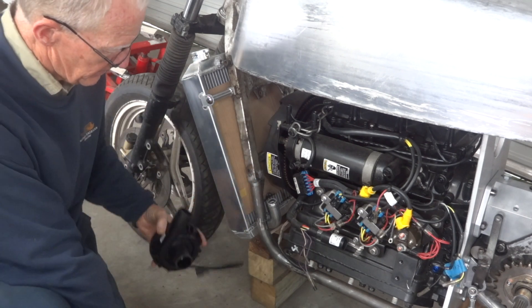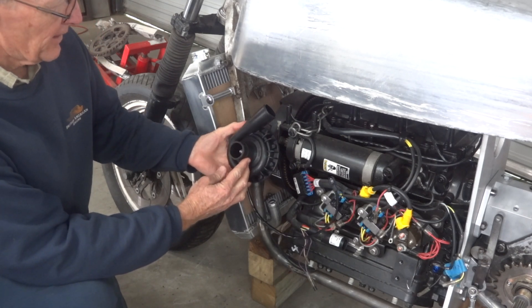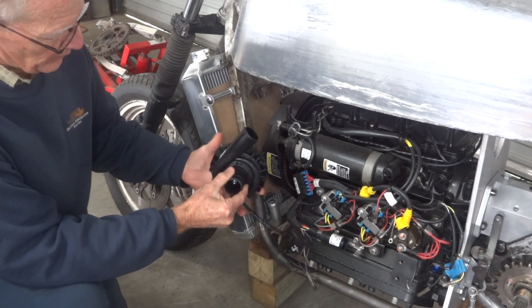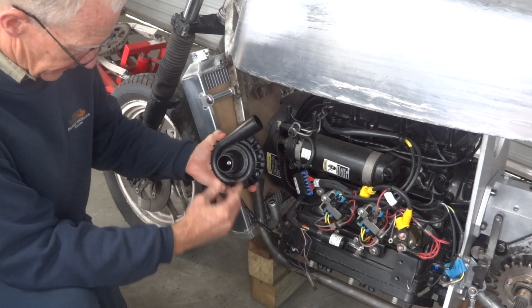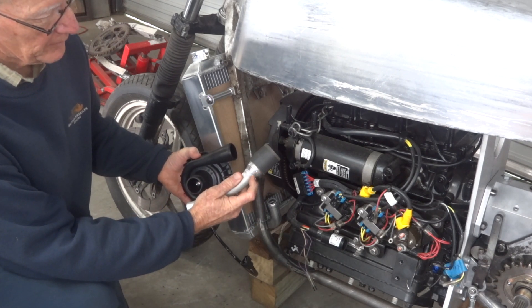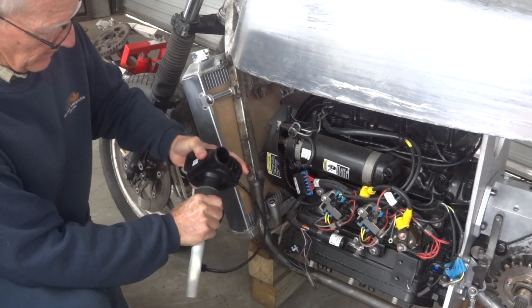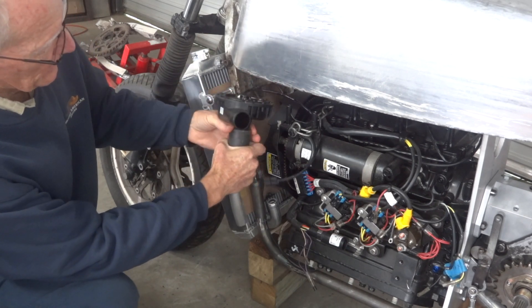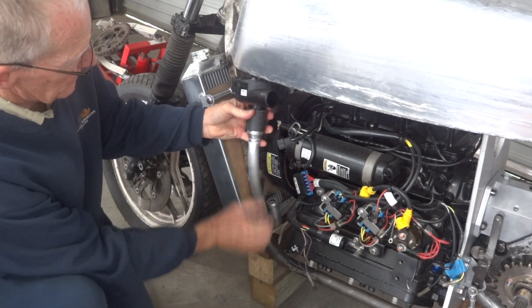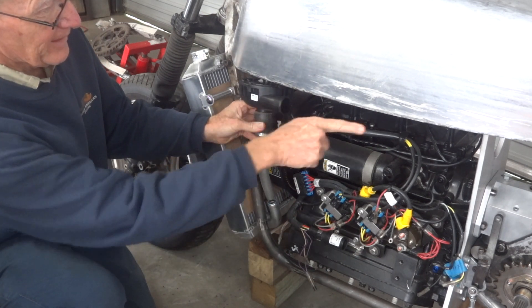The water pump I've chosen is not the smallest one in the range — it's 115 litres a minute rather than 80, to try and shove some water through this thing. It's got a whacking great inch-and-a-half inlet and outlet. To deal with that, there's the inch-and-a-half bit of pipe, but I've just turned up a little machine from solid with a little conical adapter. That goes in there, hides away nicely, and with a bit of rubber hose on that it'll sit in here pretty much just like that. We'll carry on and send the water to the engine that way.